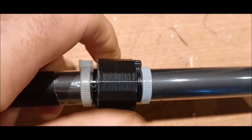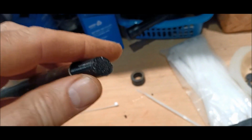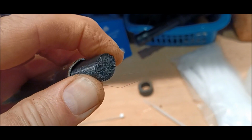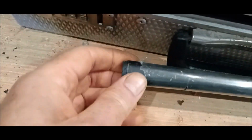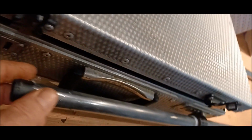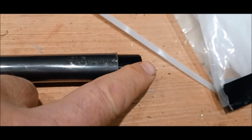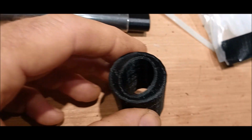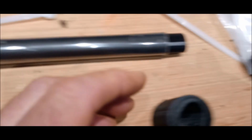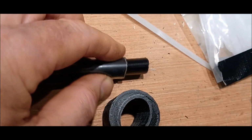That can either spin, or the whole curtain pole will spin. Here is a connection, another oval piece. You see that? That's so they can't spin. Ovals can't spin within another oval. Only circles can do that. So that's going to be connected to this end here, which I'm in the middle of crushing. The oval is coming together, not quite there yet, but once it is, this is the core, and over that will go this bit. There's an oval shape there, similar to these parts, except the inside is oval to go over the crushed end.